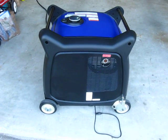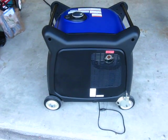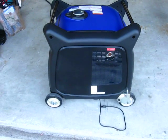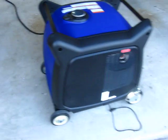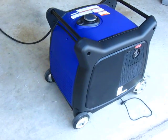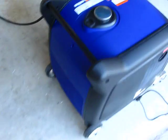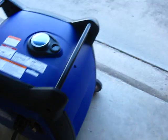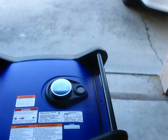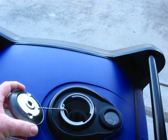The muffler is on this side. You'll notice a wire coming out of the bottom through a hole that seemed handy, because there is no pull start on this — it has a 12-volt 18-amp-hour battery inside that you have to connect when it comes new. I felt that if it just sat for long periods of time, which emergency generators typically do, I didn't want a dead battery. It would be a problem if you had a power outage and couldn't start the thing — you'd have to jump it.